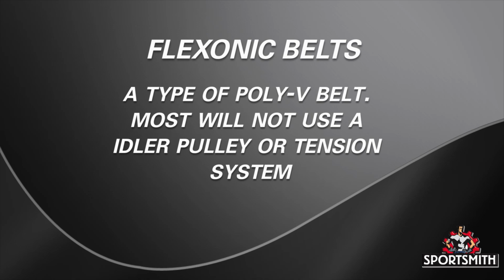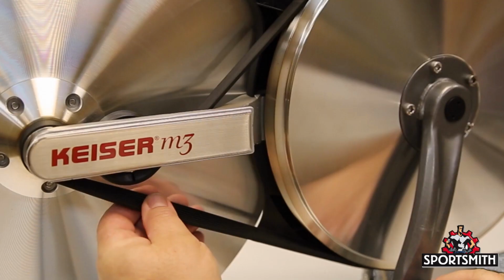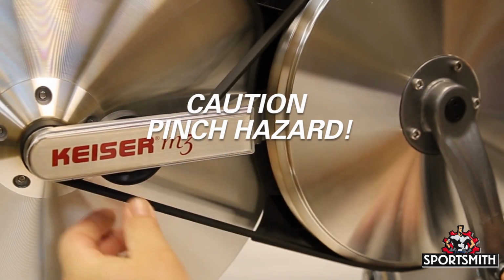FLEXONIC belts are a type of Poly V belt. They also have lines around the circumference of the belt, but most will not use a tensioner system or idler pulley. These belts are designed to be very tight. So tight, in fact, that we hear from our customers who are having a hard time getting this belt off.